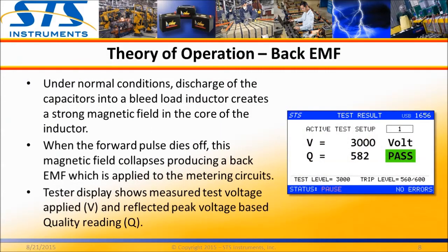The reflected peak voltage is a measure of the cell's integrity and is measured to calculate a quality factor reading, Q. A known good battery element or cell will have a reflected peak value that falls into a narrow range. The tester compares the Q reading against this preset pass range and passes if the cell is in range. If it's out of range — either too high or too low — it rejects the cell and generates an alarm. The tester screen on the right shows a passing result.